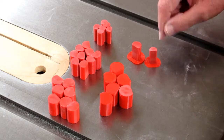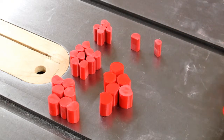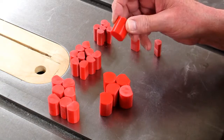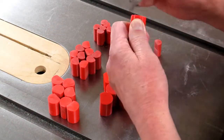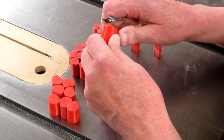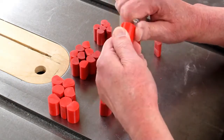These are all printed on the Ender-3 and they're all printed on a brim. The brim comes off — you throw that away — and it leaves a bit of a burr on the bottom. I use a file, just drag it across that, take a sharp blade and scrape that off. Do that until the burr is completely gone.